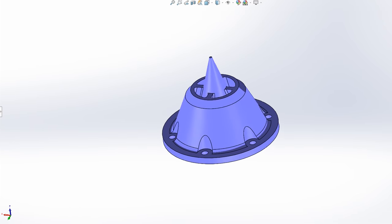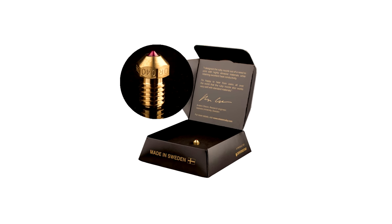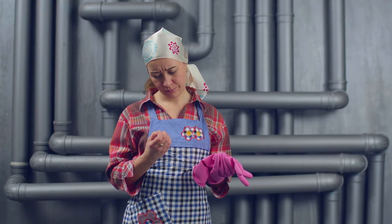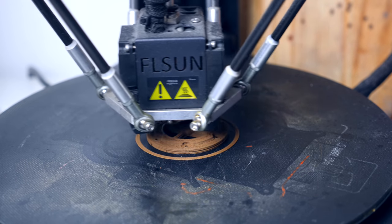The first step is to choose a 3D model to print. Because I love engines, I chose an Aerospike rocket nozzle. Obviously. The obvious next step is to use my 3D printer to print the rocket nozzle. But because the filament I'm using has bronze powder in it, which might damage my fragile brass nozzle, I got a new and improved super resistant ruby nozzle. The ruby nozzle has ruby on the tip that is as tough as nails. Next I 3D printed my rocket nozzle in bronze filament using 100% infill so I could get a solid part.